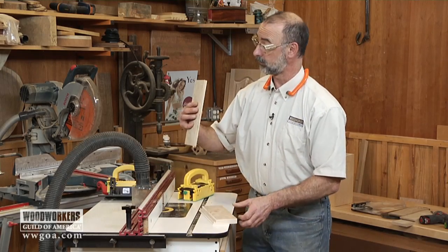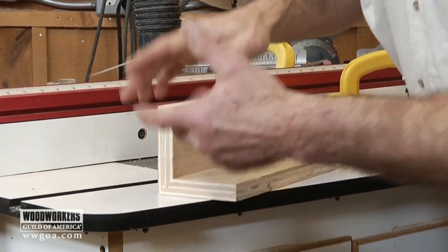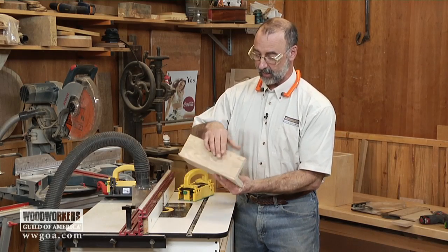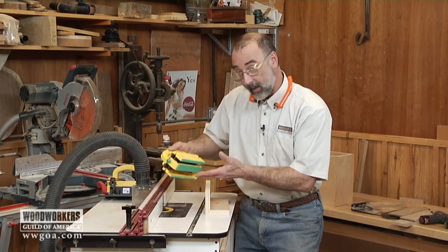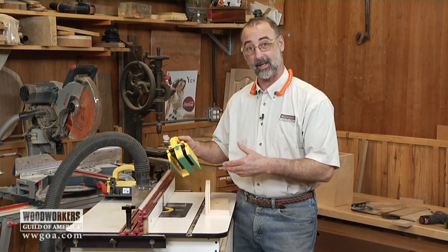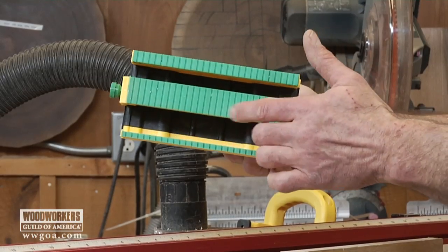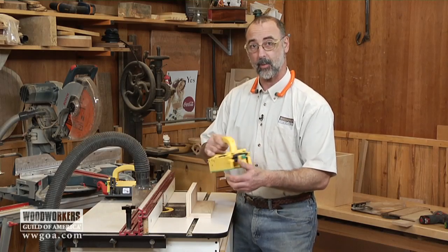It sure is cool when you get that lock miter to snap together. Great mechanical integrity, great surface area for glue, and it really looks good on the outside because both pieces end in a miter. Now, part of what was happening there was we've got quite a bit of backward cutting pressure from that bit leaning on the material like it is. We're taking out a lot of wood at one pass. So in addition to a push pad here to grip the material, having a hook on the back of your push pad is very beneficial so you can counteract the cutting pressure of that cutter.